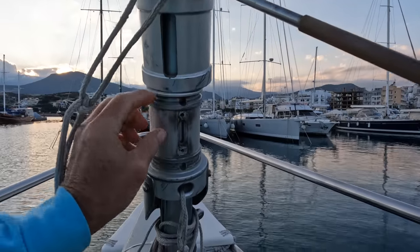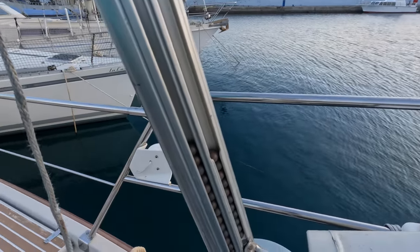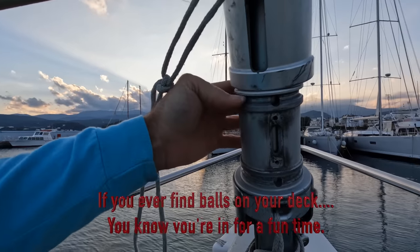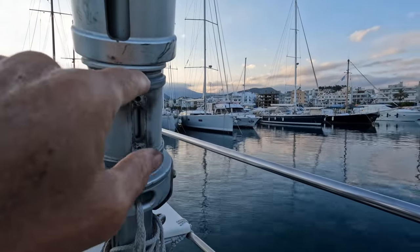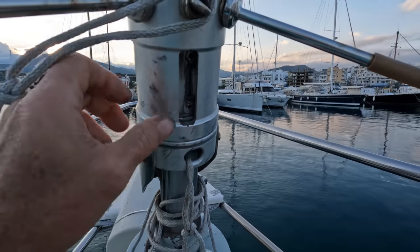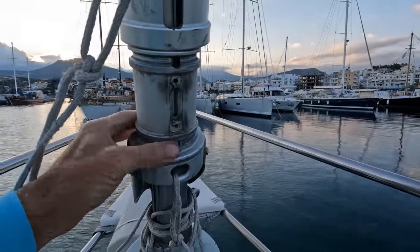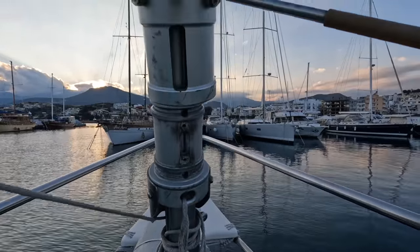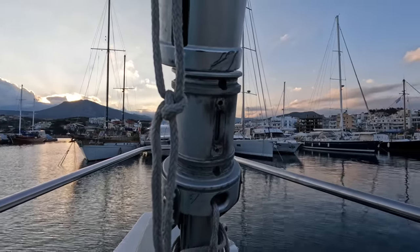Here is the forestay swivel. In these grooves here there's supposed to be a bunch of ball bearings - you can see a lot of the balls are sitting in there. We're going to get new ball bearings and clean this up, but one of the things needed is a stopper that goes right here to keep the ball bearings in the track but not go back through the hole. Inside these tracks you have your ball bearings, and that's what keeps this from going up. According to my friends over at Amel, they don't sell the stoppers anymore - they just say they don't make it, sorry. But they don't tell you how big it is or what it's made of.